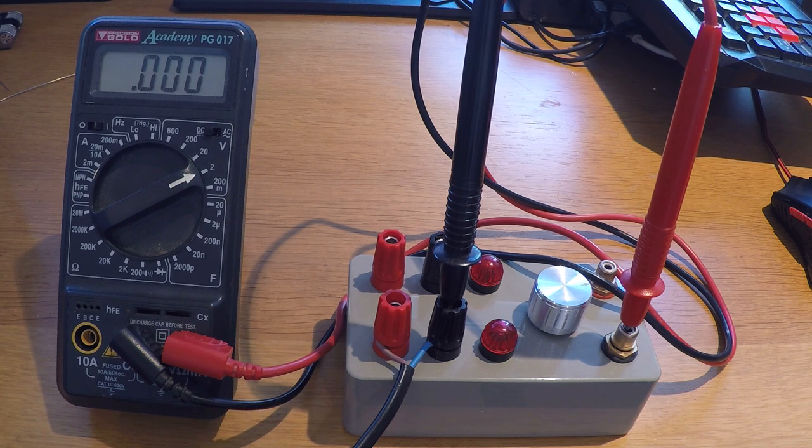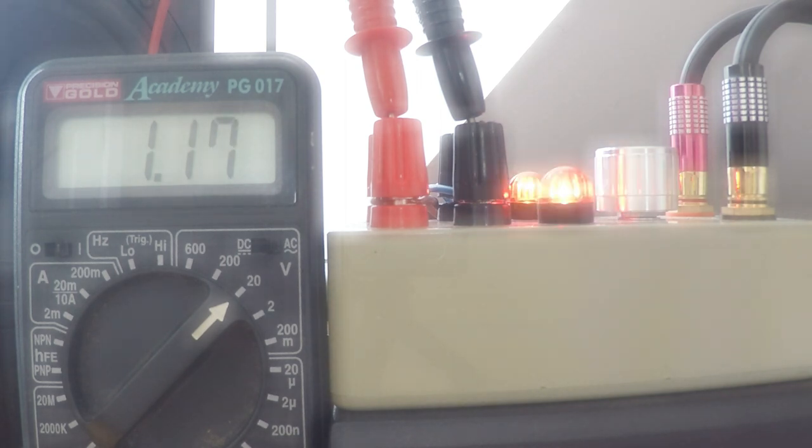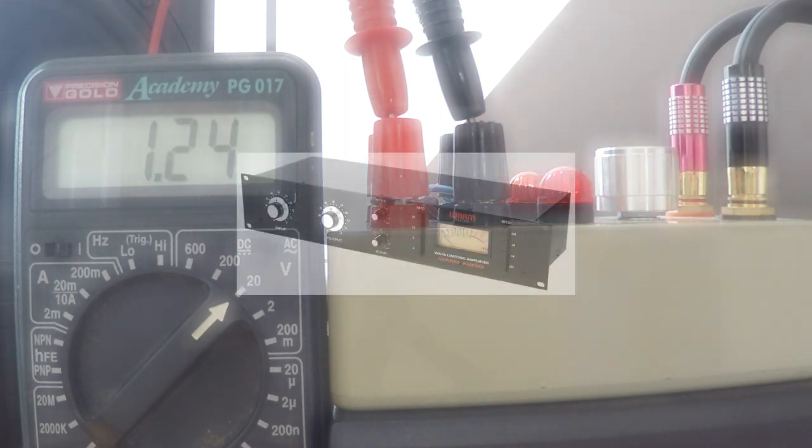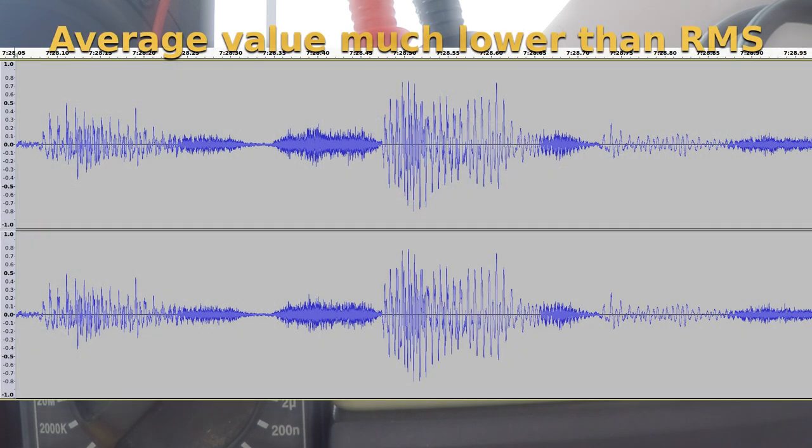As the temperature of the filament, and hence the attenuation of the compressor, is directly proportional to the RMS power dissipated across it, the compressor operates in true RMS mode, which closely matches the ear's perception of sound and results in a very natural characteristic. A great many other compressors use averaging, which quickly becomes inaccurate when peaky waveforms are present, such as with this recorded speech waveform from the past sentence, shown here.